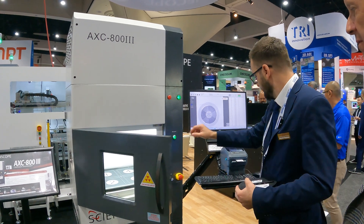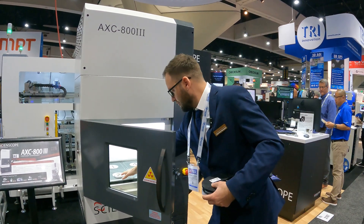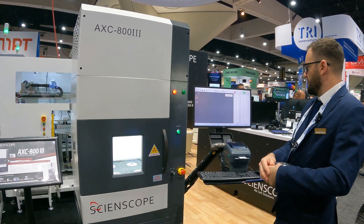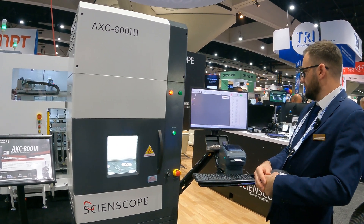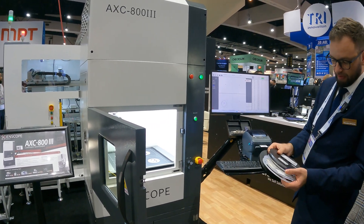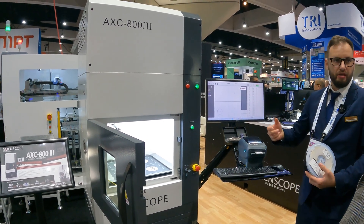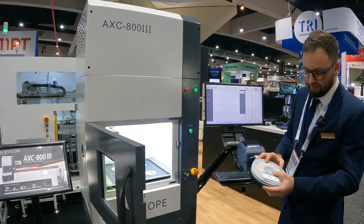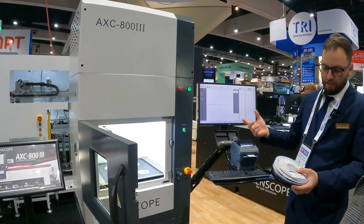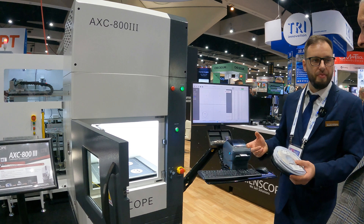For loose bags, let's try — it may be a bit difficult to pick up because it doesn't have a barcode, but it should be able to count it without any problems. Also, if you look closely, reels often have multiple different labels — the system reads only the barcode you've set it up to read. If it doesn't find it, it will say 'code failed' when you pick it out and show a pop-up where you can input the barcode manually, for example if it's deteriorated.